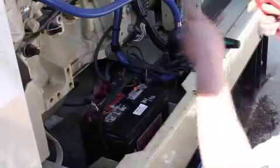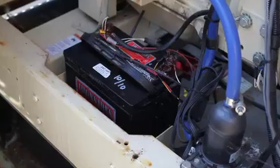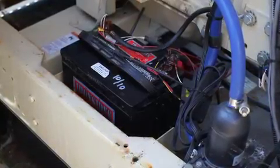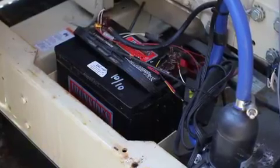Obtain printout of battery condition and ampere hour capacity. Connect meter across battery to determine battery cell voltage. Visually check for leakages that could result from a cracked battery case or spilled electrolyte. If the battery cannot be repaired, it should be replaced.